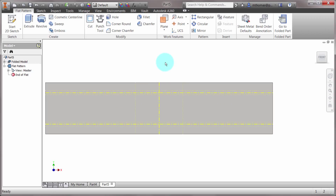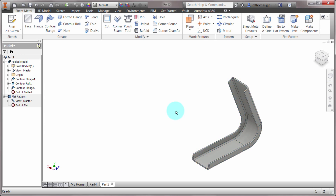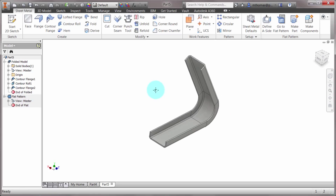It's going to roll that out and flatten it for me based on my styles to give me that shape. It's a neat tool you can use to create these different types of shapes, and the power comes in that it honors your sheet metal settings — it honors that it actually has to be built out of metal — and you get an unfolded part you can use to create your flat pattern for bending and folding the shape.